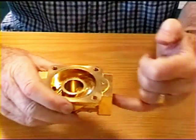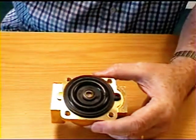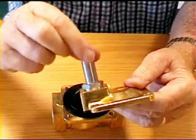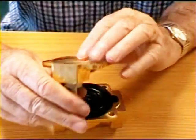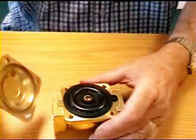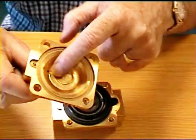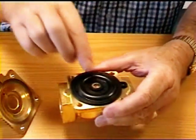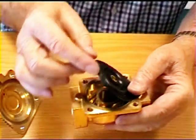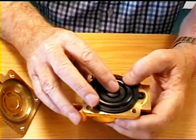The pressure going in here opens this valve by means of this tube, and in this tube is a plunger similar to the last one, with a seal that sits over that hole. When you lift the plunger, media coming in through this hole is allowed to go through and come out there, allowing pressure to equalize between the top and bottom of the seal so it just pops up. That is why we call it pilot operated — it's the pressure of the media that makes it work.